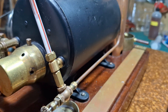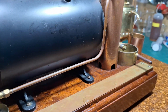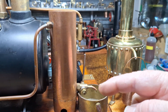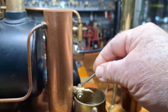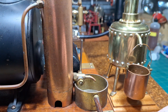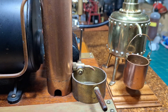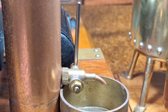Here's another PMR globe valve that I used as a blowdown, so I can blow down the boiler. It runs along into this copper tube that I made up, and I made this little stopcock so I can empty that into here — just made that little receptacle so I can take that water away. That's a really handy feature of this boiler. Really happy that I made that stopcock.